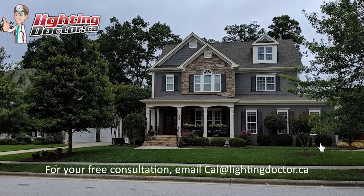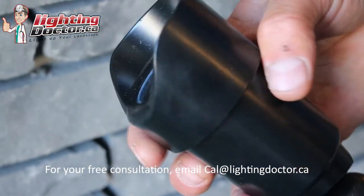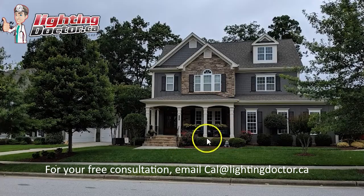You've got some cool things in the back that I'll talk about, but I think where I'd start is on the house using some standard accent lights or up lights. I would definitely try and light these four pillars — mount them in the ground fairly close to the house, maybe about 12 inches back, shining straight up on the two front pillars, catching the corner pillar, and then one on the other side to catch that pillar as well.